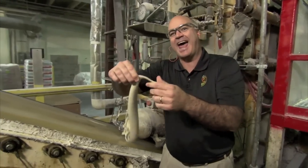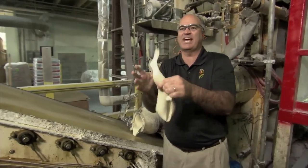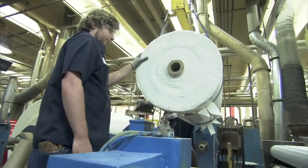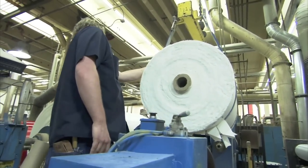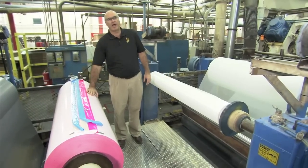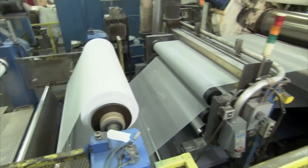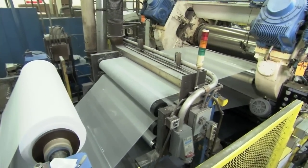As you can see, it's a lot like taffy — very stretchy, but very sticky now. With the adhesive done, we're ready to make the rolls. We're going to take the cloth scrim and the poly film, unwind them together, and send them into the calendaring unit. At that point, the adhesive slides through the cloth to the film, forming that nice tight bond.